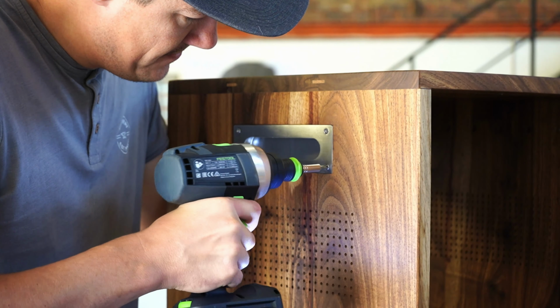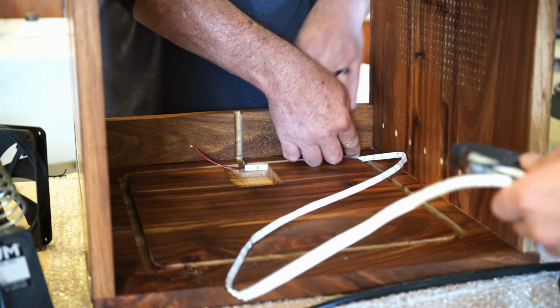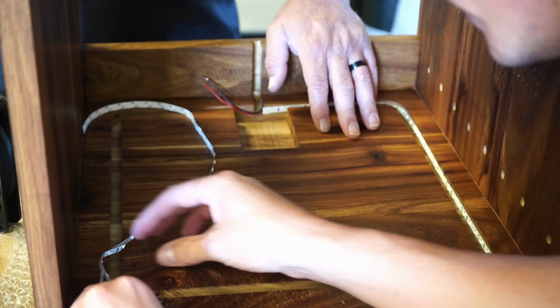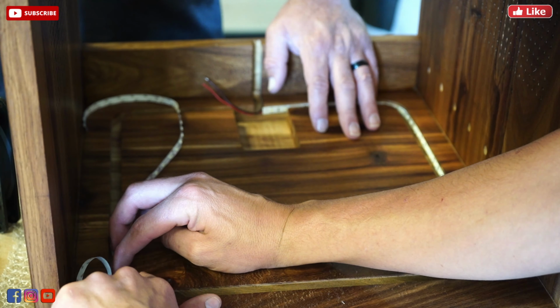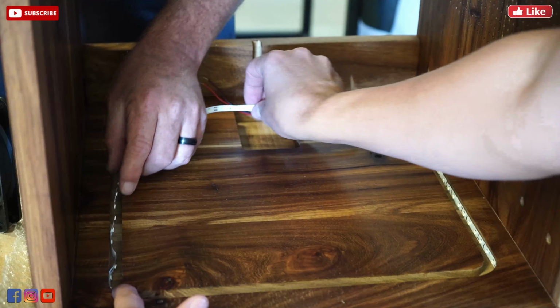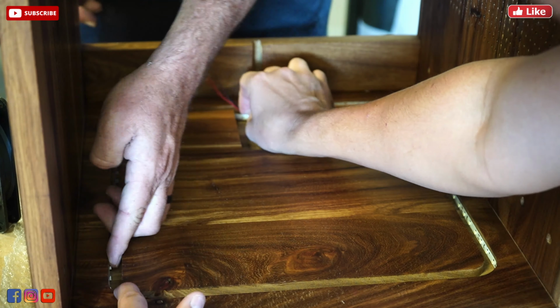And you'll see the box is turned around now, so we are working on the top side of our biltong box. And we cut with the CNC machine a groove on our top piece of timber, so you don't see the LED light. And it's also quite critical that inside this groove you don't oil, otherwise the strip for the LED is not going to stick to the wood. And we did end up applying a little bit of glue just to make sure it's not going to come loose in the future.